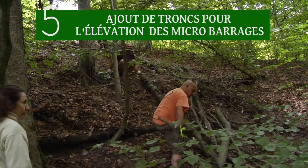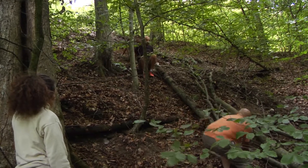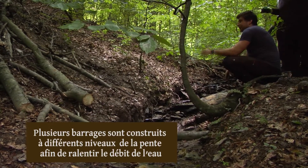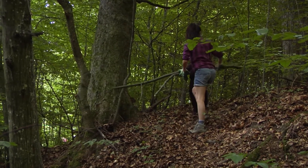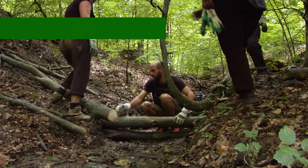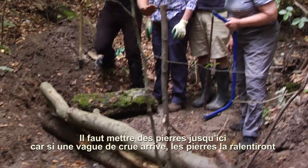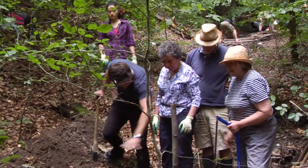We have all the logs for the other structures as well. We'll use this one here for us because we need another three logs on top of here, so it comes up to this level. We cut the pieces for our dam and the rest we can send down there. I would fill the area with rocks up to here, because when a flood wave comes, the rocks slow it down. If there's just mud here, it'll wash underneath. So rocks up to here roughly.